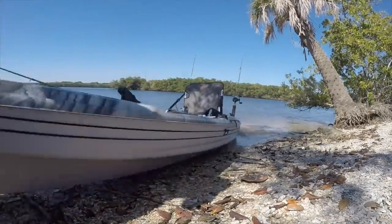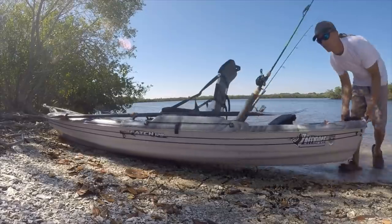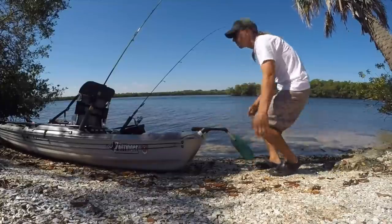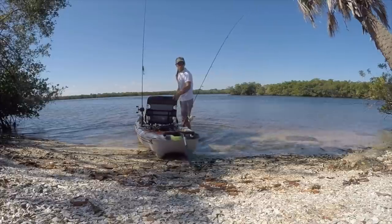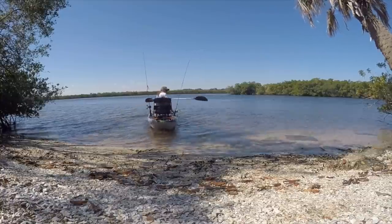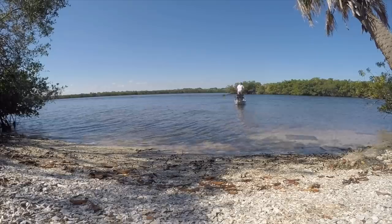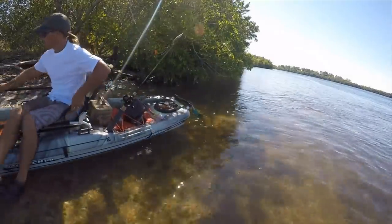The reason I didn't do this on the boat before I left is because you can't really tell what position the skeg has to be in — little tiny micro adjustments will make it so that you're either pointing in one direction or the other. If it was really crooked, you would just go around in circles. So I crammed it in there as best I could and took it out for a test run. You can see it's up out of the water, and then I reach back and pivot it down into the water. Right away I could tell I was turning to port just a little bit, so I came back and readjusted it.